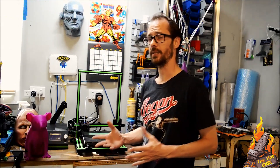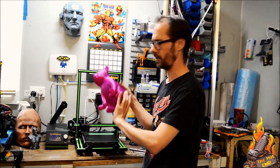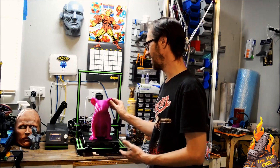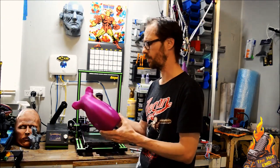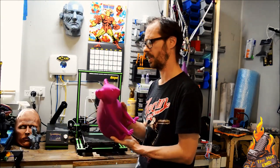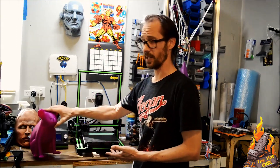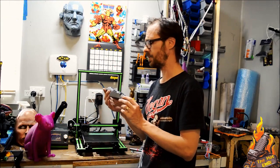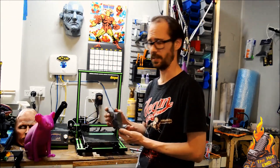Over the last couple of weeks I've given this a pretty good go. The largest print I've probably done would be about a 13-hour print — not max size, but close to max size. I printed this at 0.3, so the layer quality wasn't fantastic, but it was just enough to see if it could actually do the job as far as a long print goes. I did print a lot of other small things. The main issues I had with this machine were cooling, really — the PLA cooling fan is just non-existent. It is there, but it just doesn't do very much.